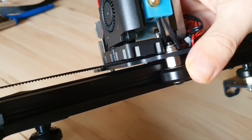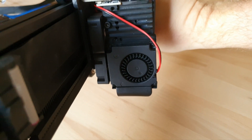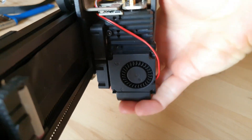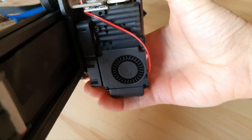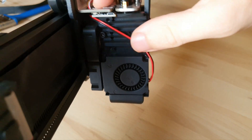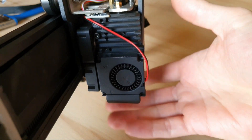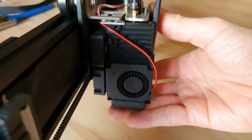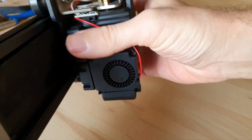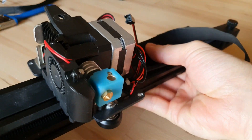It's really important to get the pressure just right here — this is one of the most important spots. Because if you think about it, when this is printing and the carriage is floppy and just falling forward instead of nice and firm seated, then the auto-leveling sensor might be thrown off a bit. Also, any bumps will set your whole carriage a bit off, and it can mess up the quality of print in a lot of different ways.